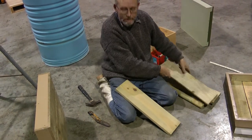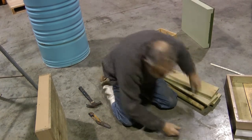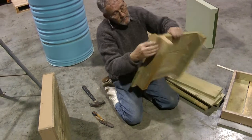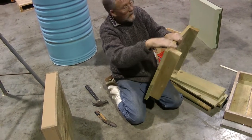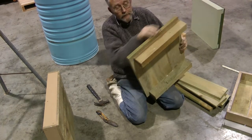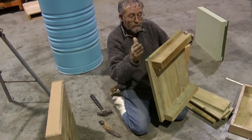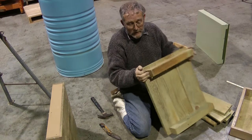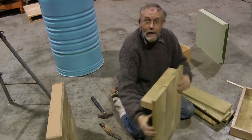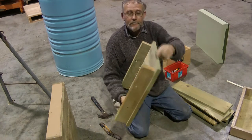And how do you take it? As long as I've got one straight side. And then I start by nailing it up. I start with a decent board and start flat on one side. Nail it up as so. These are all random sizes, and then when I'm wanting to take it to size, I run it through the saw bench at 406 millimeters, and I'll whip that off, and that does for my risers.